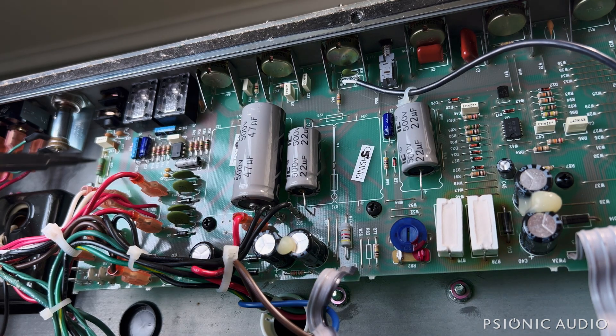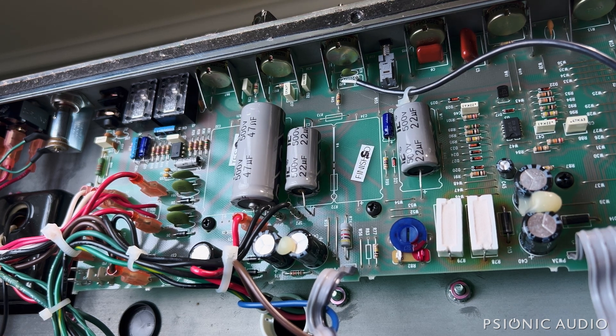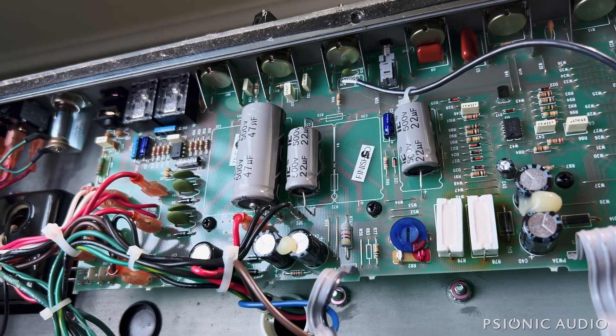There's a little bit of browning around this 2-watt resistor here as well. So far, pretty typical stuff. Let me power it on with a current limiter and see if there are any other problems the amp might have, other than the possibly wonderful sounds of a failing screen grid supply.